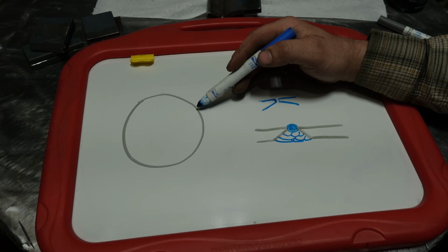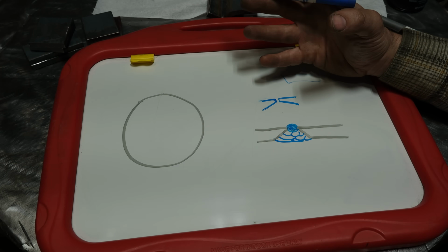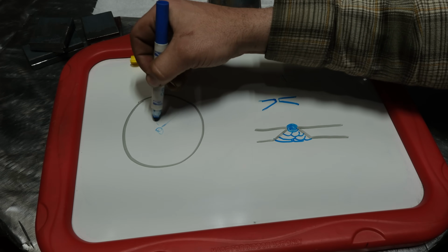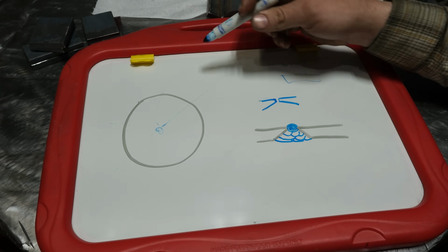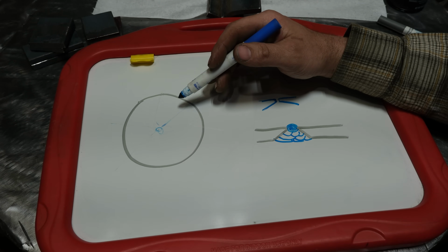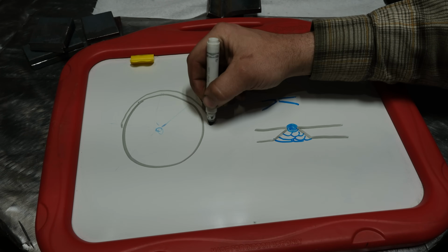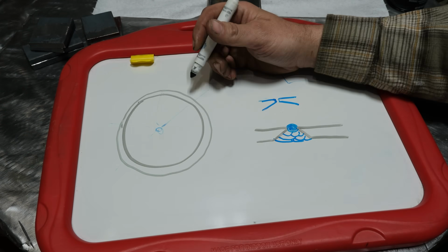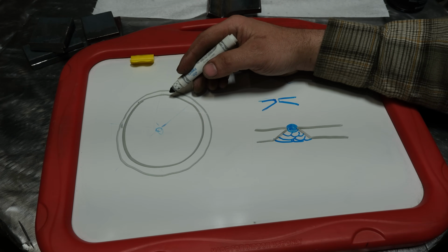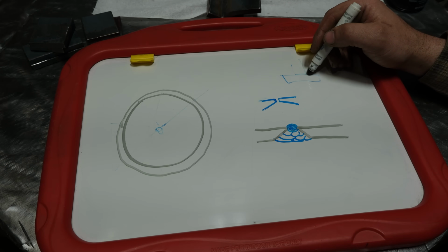And secondly, when you look at pipe, pipe is meant to hold liquids or gases or whatever have you under pressure typically. So the pressure comes outward. And pipe is not typically done for structural purposes. Therefore, having a 7018 weld all the way around the outside with a 6010 root provides an incredibly strong joint that will resist any kind of pressure you might have, because that root pass down here never sees the stress of what a root pass might see on a fillet weld.